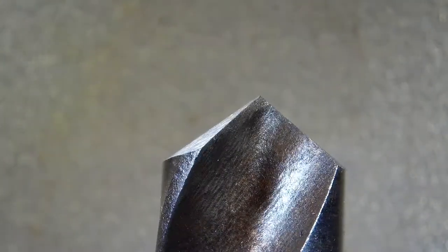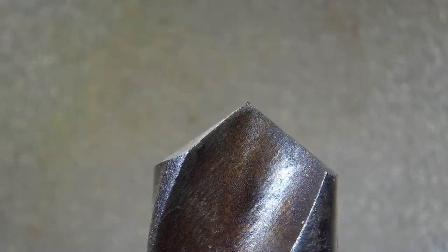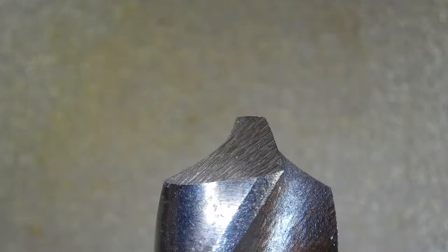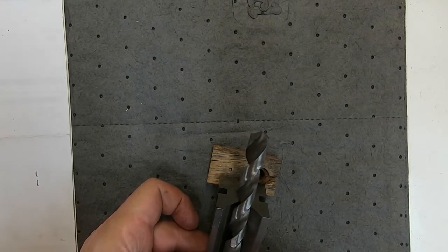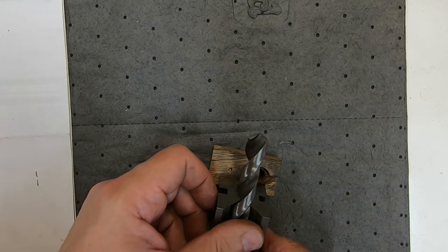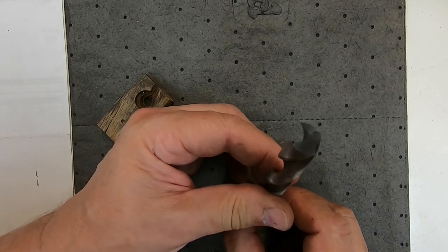Let's have a closer look at the tip of the 7/16-inch drill — this is video taken after it had drilled its hole — and a quick look at the inside of the hole to see what sort of surface finish we've got. The cutting lip stood up pretty well, and I was quite pleased with the surface finish in the hole. I used a hole gauge to check the size and it came out to about 0.1 of a millimeter oversize. I decided to call a halt here with the conical grinding jig — getting a reasonable finish is good, but the limits of that jig are all too obvious. I'm going to move on to having a look at the four-facet grinding method and see what sense I can make of that.